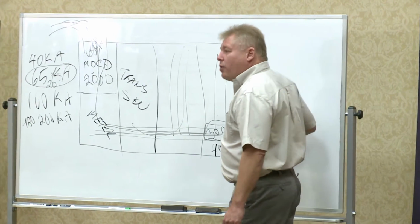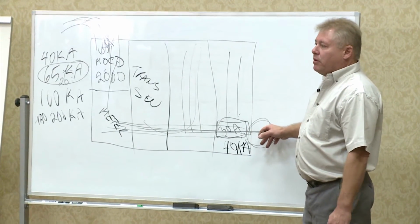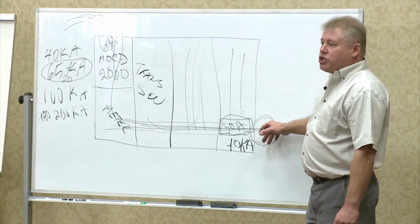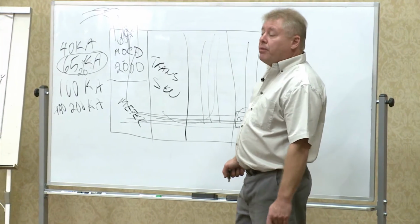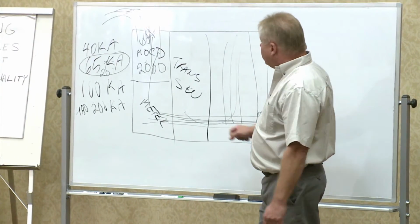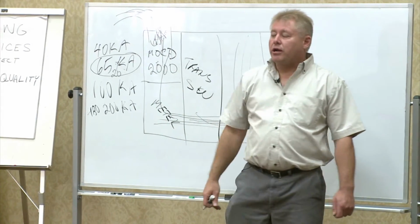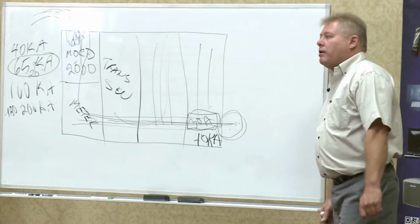So the CleanVolt is shunting all that energy into itself, and if it's a lightning type surge event, then it opens up like a shunt and drives it to the neutral ground. That's why it's good to have a well bonded neutral system. Allowing this to reach its maximum, and it literally turns it off. The surge is no longer coming into your building.